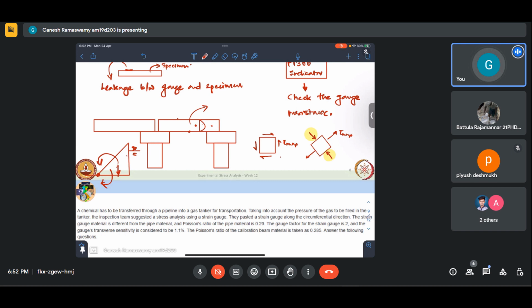Whereas if we go to a bridge structure where we are optimizing, why did we go from a box section to an I section? Because we found out that for bending members, the farther we put the material away from its neutral axis, the better it behaves. I is also dependent on the distribution of the area. It is a second moment of area, right? So distribution of the area also becomes important. In such cases where we have optimized, we want to make sure whether it will hold or not.